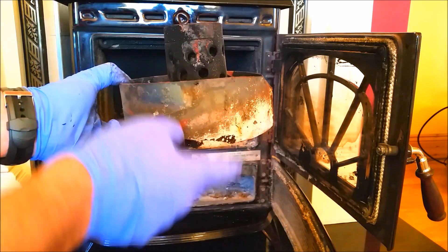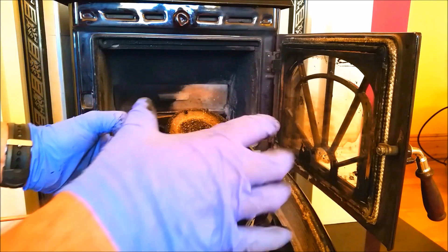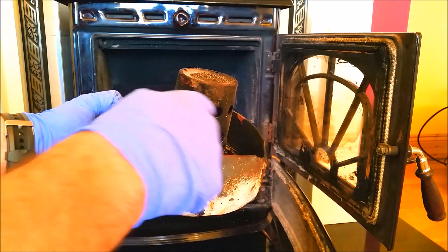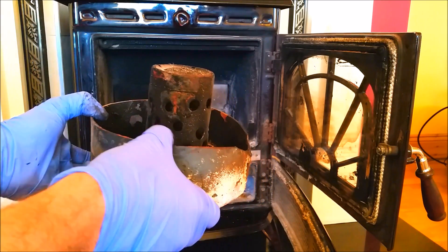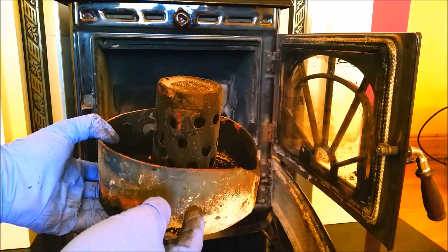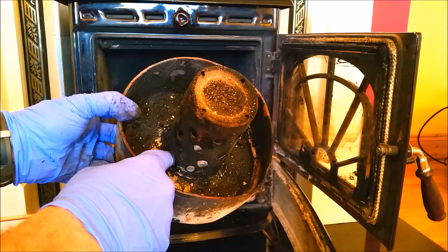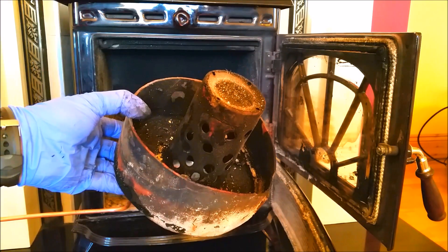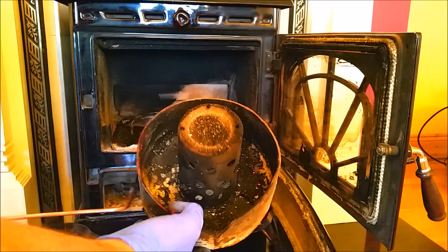This is 3 inches in width and height, 7.5 inches in diameter from there to here. This was a propane tank - a propane bottle. I just drilled holes every inch all the way around. Those holes are about 10 to 12 millimeters in diameter, all the way around, with 1 inch separation. When you get to the end, if it's too much, just half the distance and off you go. They start at about an inch off the bottom of the burner, and there are 4 rows of holes. You could try 3 rows and see how you get on. There's nothing written in stone on this - it's trial and error.